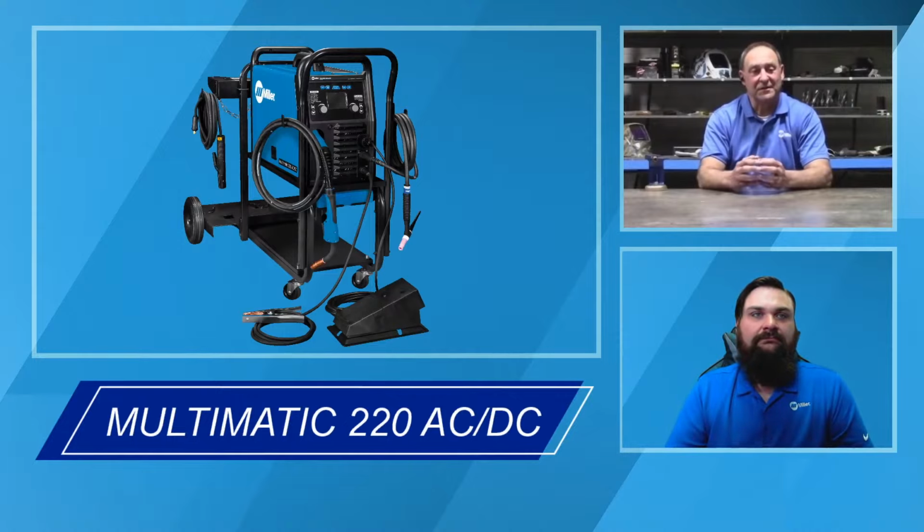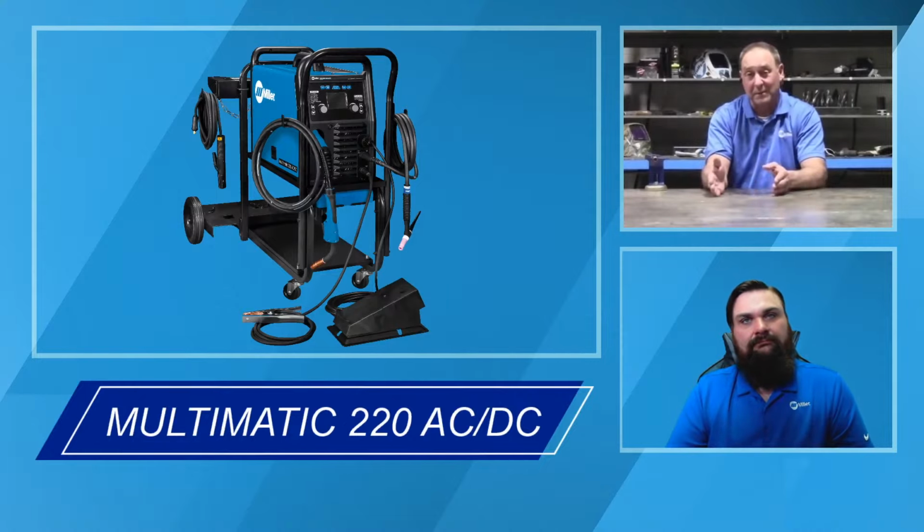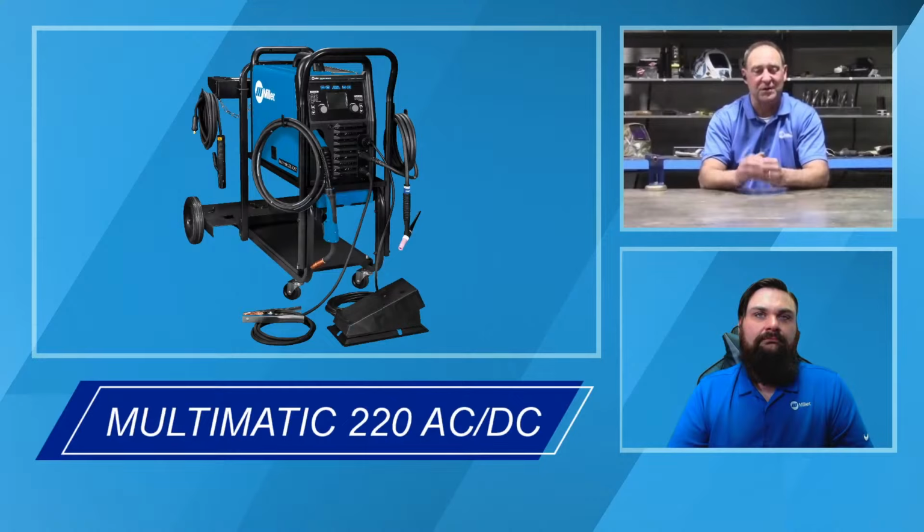Yes, as far as the new inverter machines, we have a large variety. Some of the smaller units have technology called MVP technology, where it can work off of 120 or 240 capabilities. And then some of the larger machines, our Multimatic 255, has a technology in it called Autoline technology, where it can run from 208 up to 575 volts. And the nice thing about that is the name reflects it's Autoline. There are no jumper links or tools to change your primary voltage. You just plug it into the wall.